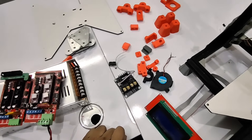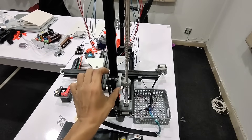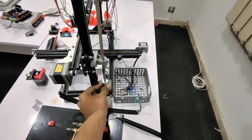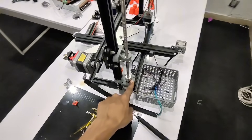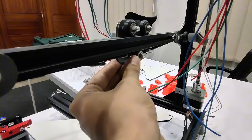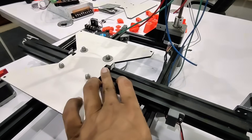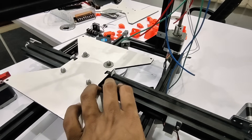On the Z-axis you can see the screw rod holder, brass nut holder, motor mount, and a 5-to-8mm coupler to connect the screw rod with the NEMA 17 motor. Both motors are parallelly connected so they move in the same direction. To set the belt on the X-axis gantry you can use a grub screw and zip tie to hold the belt. Similarly, the Y-axis gantry already has a place for the belt — you just insert it and tie it with a zip tie.